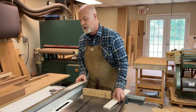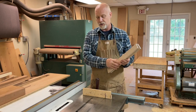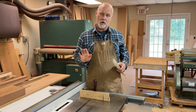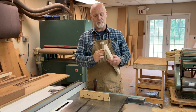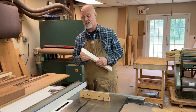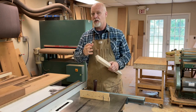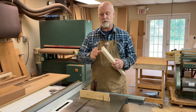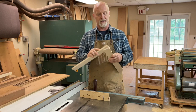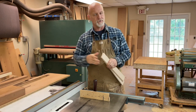We've set the table saw fence just off the distance from the edge of the blade to the thickness of this piece, and we're going to use the sliding miter to make sure that we're passing this piece 90 degrees over the blade. What that's going to do is set us up with a nice shoulder. When we've made this cut, because you've gone through the final milling process and all of these are consistent, once we've made this cut and we've honed in on this joint, we've raised the blade to what we need it to be, and we make this joint perfectly, we are going to be able to repeat that joint over and over again. All 4 joints on the door are repeatable, and then every joint on every door is repeatable.